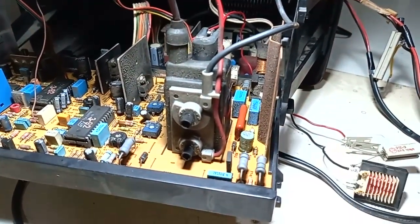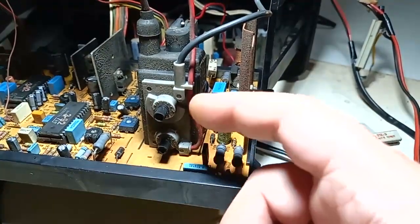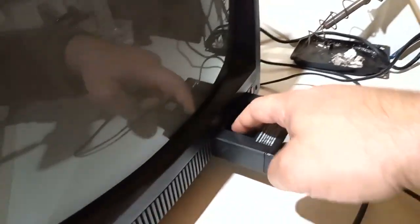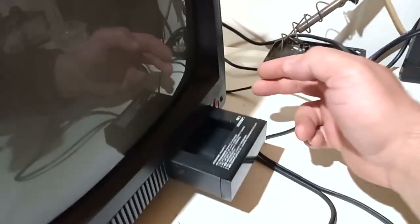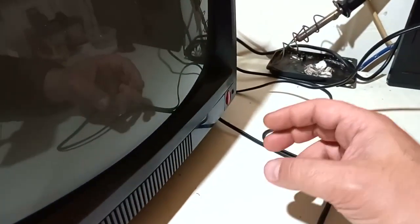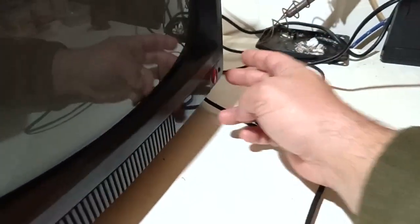After this mod, it's better to touch the potentiometers again to achieve perfect focus and manageable power for the electron guns using the trimmers. Another mod was to remove the microcontroller from the TV to avoid it going into standby mode. You just press the power button and the oscillograph turns on. I also hijacked the standby transistor so the flyback system and all other circuits turn on immediately after you press the power button.